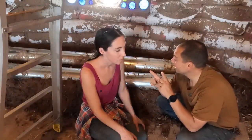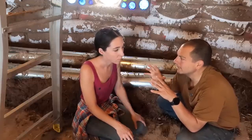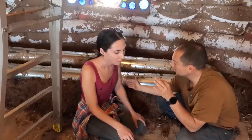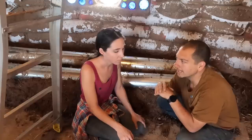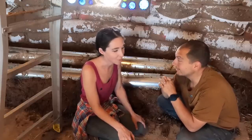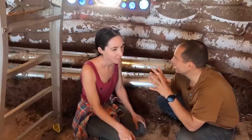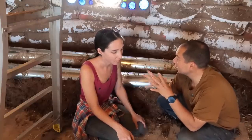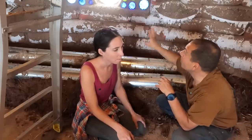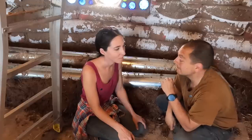Now I've got about a little over a foot on this cob — probably about 14 inches of cob over here. I probably got about another foot to go to complete the bench. Basically I just want to get the basic bench in here. I'm going to leave like an inch or so along the front and from the top, and let Jess do her thing and really beautify it. That's where she'll come in and give it her special touch. I would love to. So I'm really excited to get the rest of this bench done. That'll probably be the next phase — finish the basic bench and cover up some of the walls behind here. As long as I'm messing with the cob, I'll get some of those bags covered. This rocket mass heater is pretty close to being done, and I am excited.